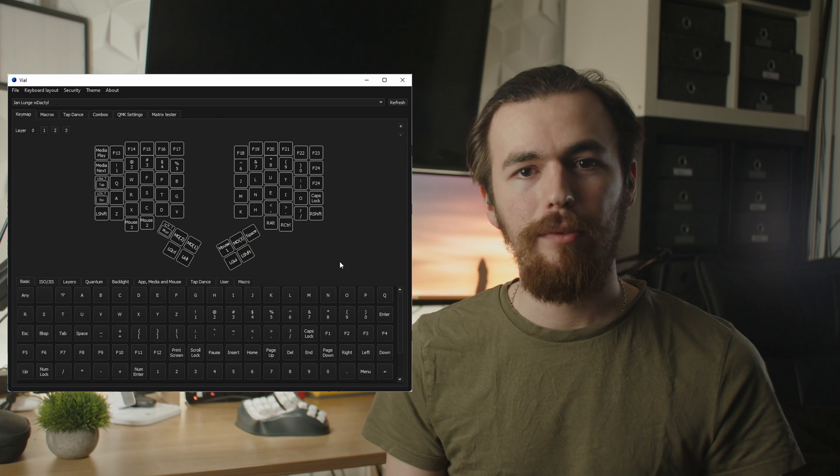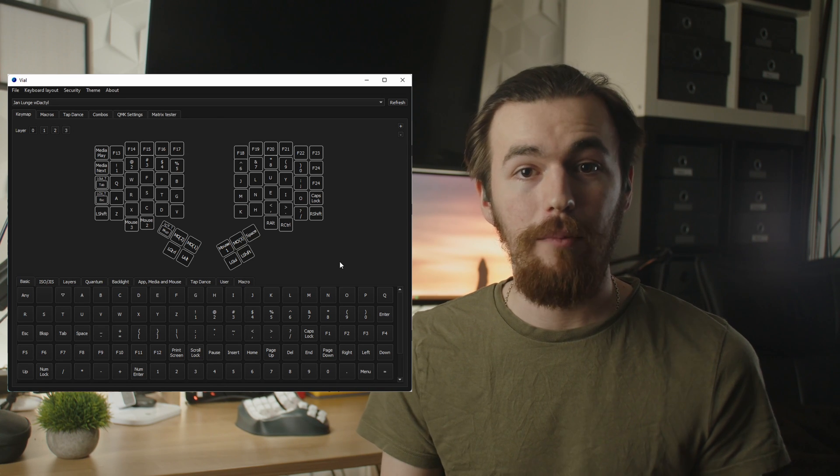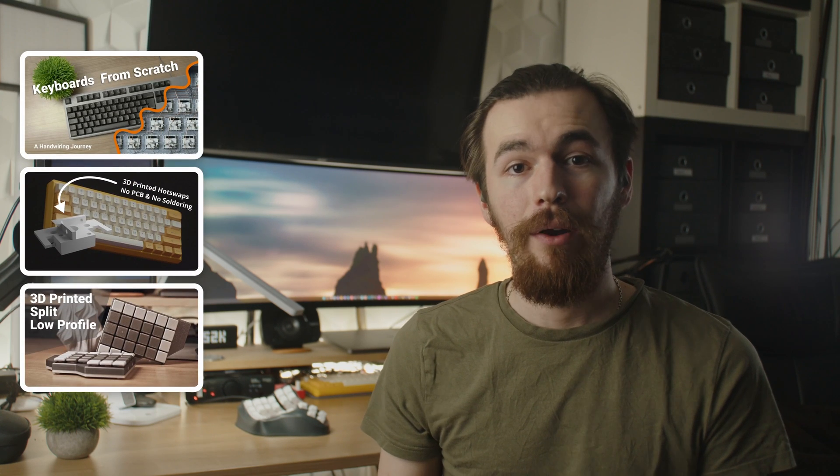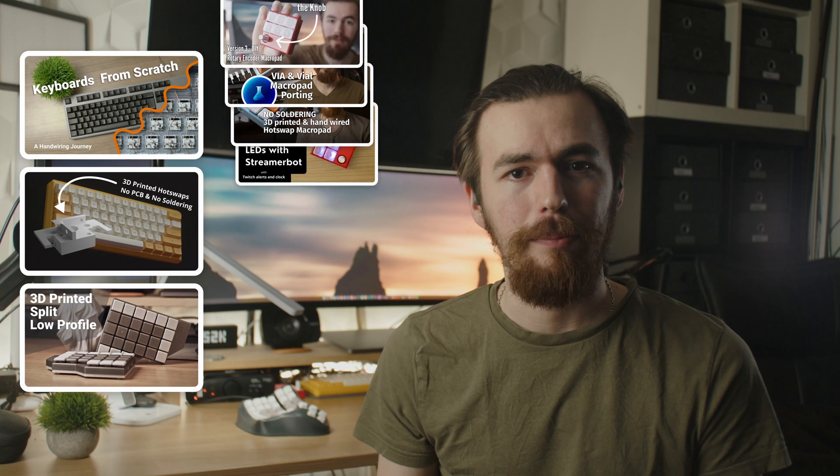I have only been using this board with Colemak-DH, this time without home row modifiers, as I have good enough access to the thumb keys. So if you're into building one yourself, here are all the source files for free, and the firmware files with Vial support, so you just flash the hex file and can start typing and customizing right away. If you need any help with build questions, drop by on the Discord, and for any feedback you have, join the discussion in the comments. Social links are in the description if you can't wait for a new video, or check out the keyboard builds I did here, or how to get the most out of your macro pad in this playlist.